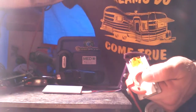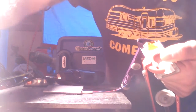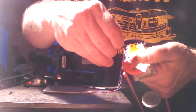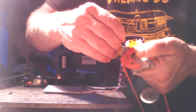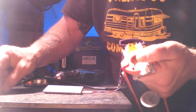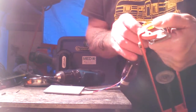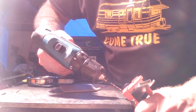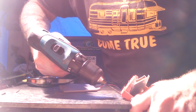But my plan is to downsize in a drill bit on the aluminum plate. I'm going to come down to this guy's size, which is, oh, I don't have a hole. Okay, there's a hole. It is loose to that hole, and that's what size this screw has to go into, so it should work out, because I think that's a bit of a self-tapper. Okay, here we go, I'm just going to finish these couple of holes in here. I've got my headgear on. It's easy, you don't really have to do a pilot tap, because of the coating on here.